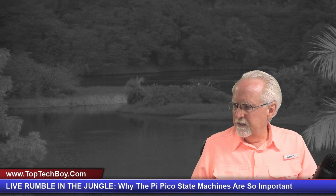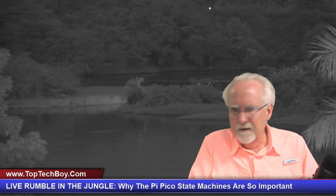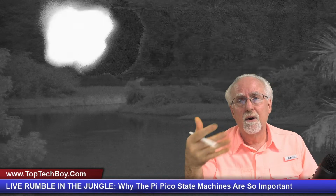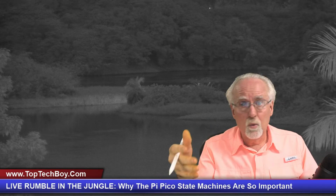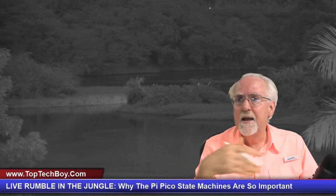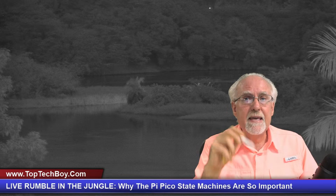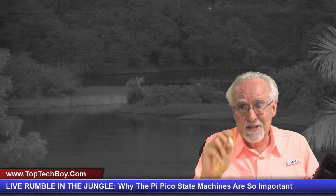Okay, let's say goodbye to that and come over to the sketchpad. And I guess what I should say first of all is why the state machines are so important. If you think about our Raspberry Pi Pico W, it will run really fast, at 133 megahertz, 133 million hertz. That's very, very fast, and that's plenty fast enough for anything that we would want to do. But the problem is, even though it can run very, very fast, it cannot run very, very exactly as far as time goes. So let me give you an example.